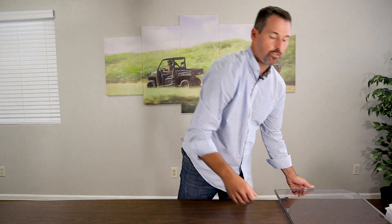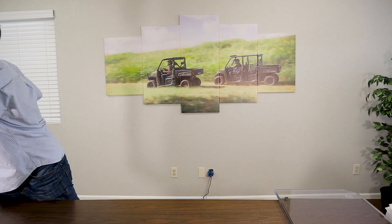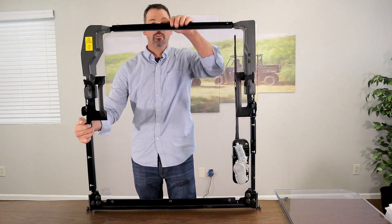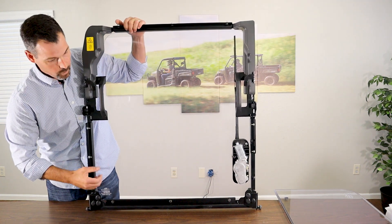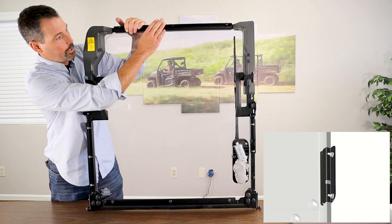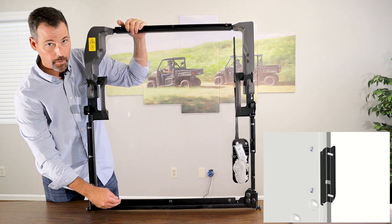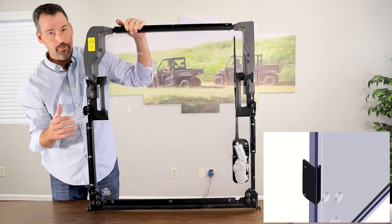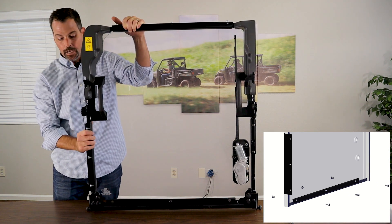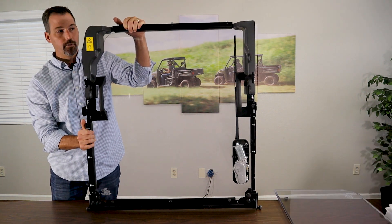Now, as we transition to the upper, you'll notice that on the framework there is a seal running across the bottom of the frame — just leave that intact, you don't have to take it off or anything like that. Works really, really well. So I'm showing you the interior view; if you were in the unit you'd be looking out. Essentially we have four different retainer locations. This is the only retainer location that is going to bolt through the poly, and what these retainers are doing is squeezing that poly against the frame and reinforcing everything so you have a nice strong bond between the poly, the frame, and the retainers.